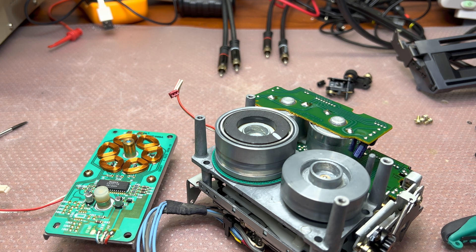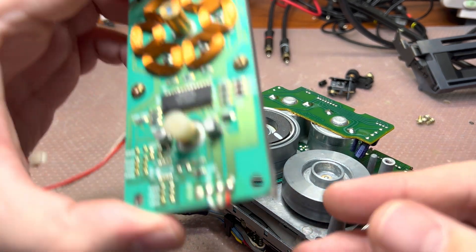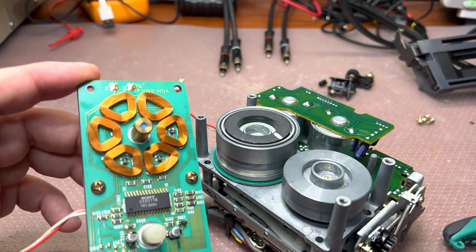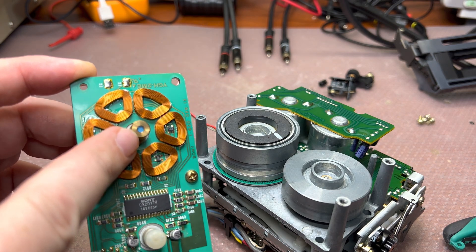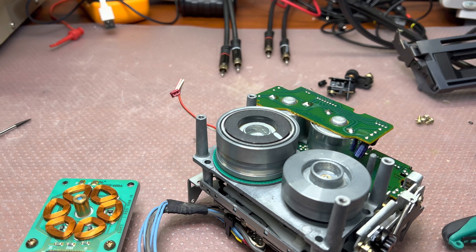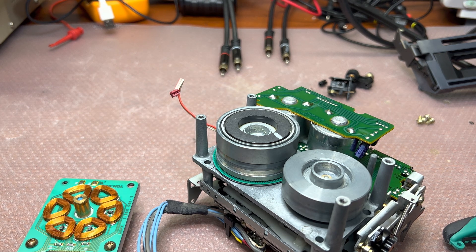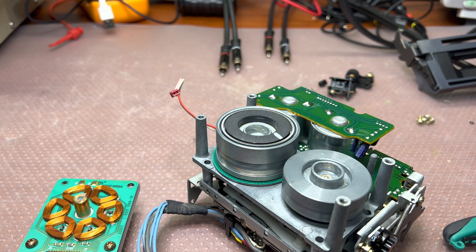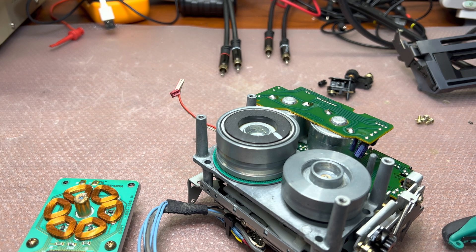You see how long it rotates — this means that friction is minimal. Next I need to put lubricant into this bearing. You see one of them, the blue one, is a lapis bearing, and this one is just plastic. That's where the right capstan sits, always in the same position, plus it's pulled by magnet to this lapis bearing, so it will always be sitting straight and not wobbling left and right.